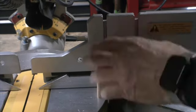You can see how the crown fits right in there, right at the spring angle, and notice that it's square to the base and to the crown stop. That means I am ready to cut. You can clean up the ends of your piece, cut square cuts. This will be a cut for an outside miter.